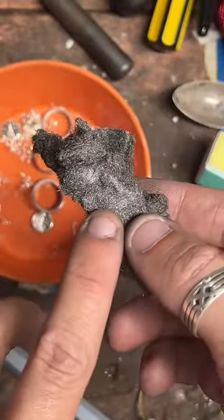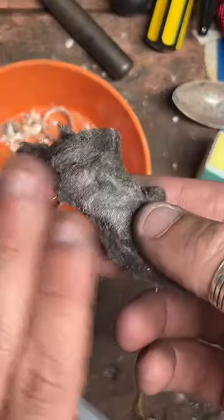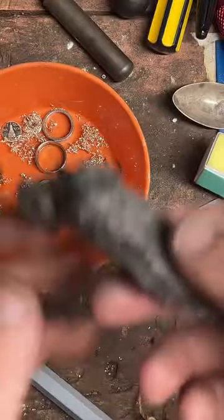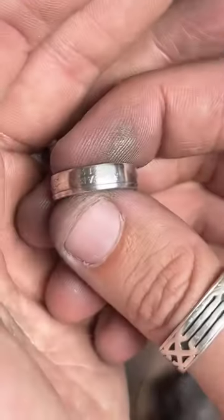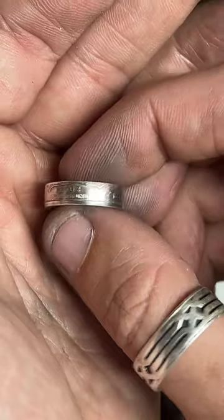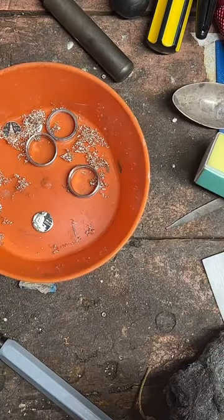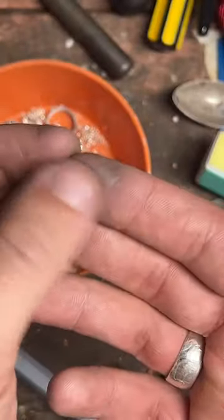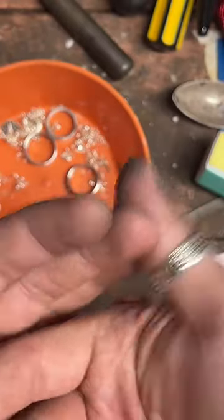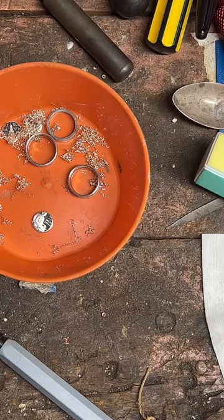So this is 4-0 steel wool. You want to make sure you get the one that has four zeros on it. Anything rougher than this is going to scratch up the surface. But this is so fine, it just gets that surface layer of whatever's on the ring off of there. It works really well. Does it leave small steel wool pieces on my hands? No, man, I just get this shininess, but I wash my hands afterwards. Doesn't mess me up.